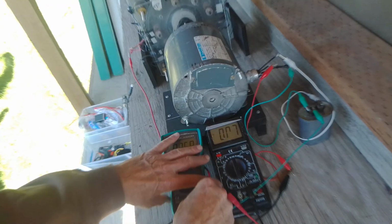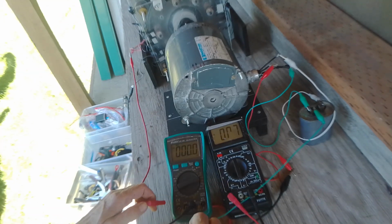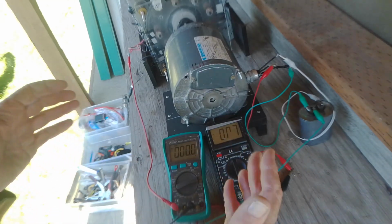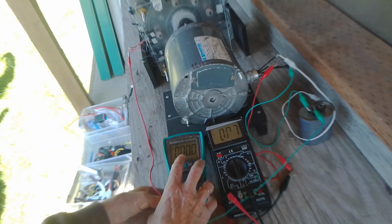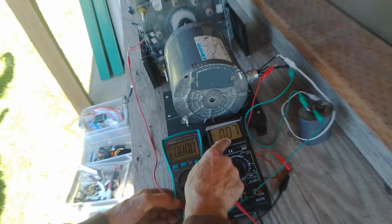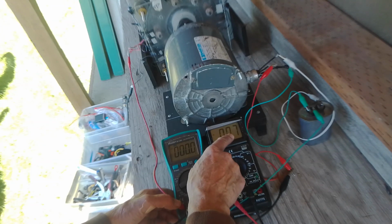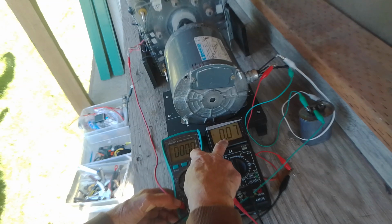Now, I'm going to do the test like I always like to do, and see what the current is when I call it crowbarring. When I short out all the generator coils at once, which are all in series, I just short them out with an ammeter. And this will give you the maximum amps, a maximum back EMF too, really. And watch this go up. It'll go up to about 0.21. Now if this was a Lenz-free magical generator, it wouldn't even go up. And I still have all this amperage being shorted out, but it does have a Lenz effect, Lenz reaction now.